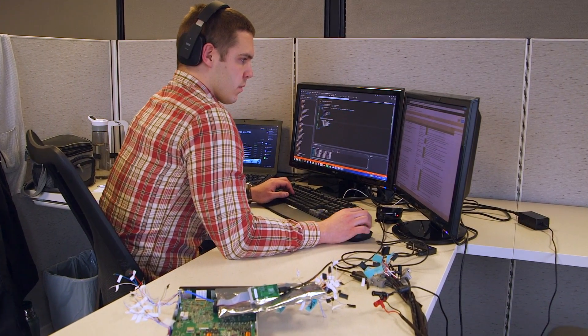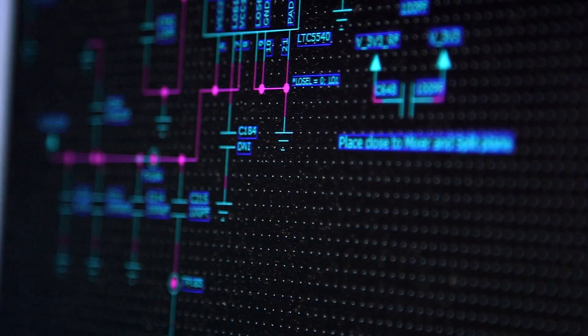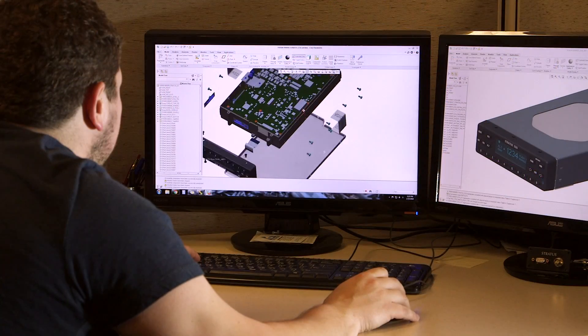What we realized from that experience is that an ADS-B out solution that depends on an old tube-based transponder was probably a bad idea. We decided to design a new solid-state transponder to replace the old one. We included a WAAS GPS so that a pilot had the simplicity of being able to buy 2020 compliance in an all-in-one box.